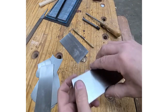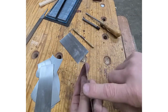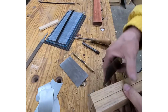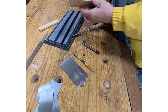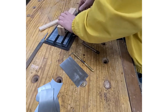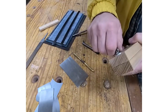Let me show you how I prepare this scraper. It comes out from the factory in France rough — this edge is rough, it's been punched, so I need to do some work on it. I'm going to use my cabinet preparation kit and stick the scraper in the vise. I'll use my rulers, which give me an exact 20 thousandths of an inch protrusion sticking out of the vise. When I tighten it down, it works fantastic — now I've got 20 thousandths sticking up.